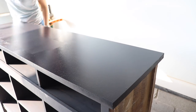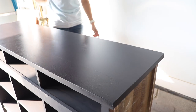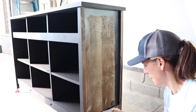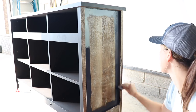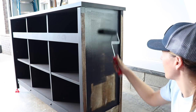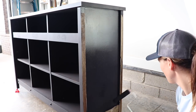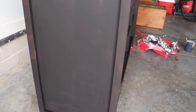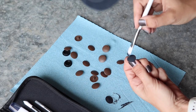Just a little tip to make your top nice and smooth when you're rolling: once you get all your paint on, I like to go all the way across in long strokes just to remove any of those roll marks. Here is what my coverage looks like after one coat — pretty good. I'm going to go in and do a second coat. I went ahead and mixed up more paint as I ran out and ended up using about 20 ounces of paint for this project.